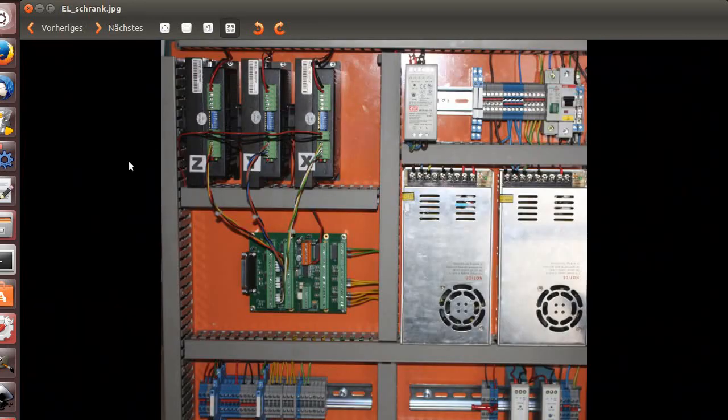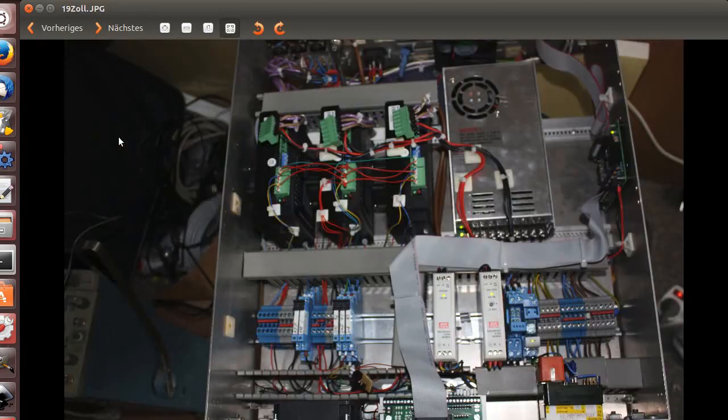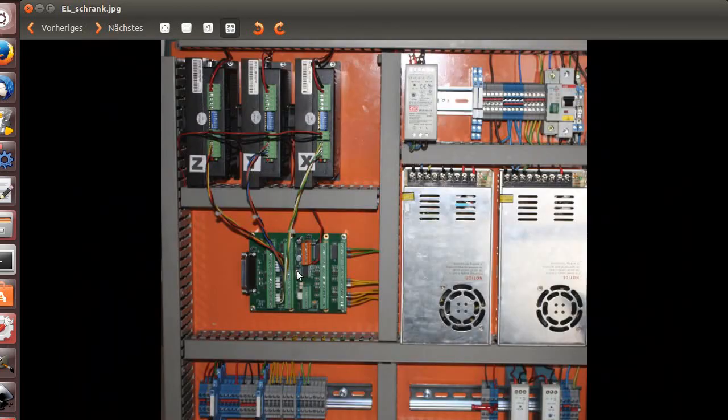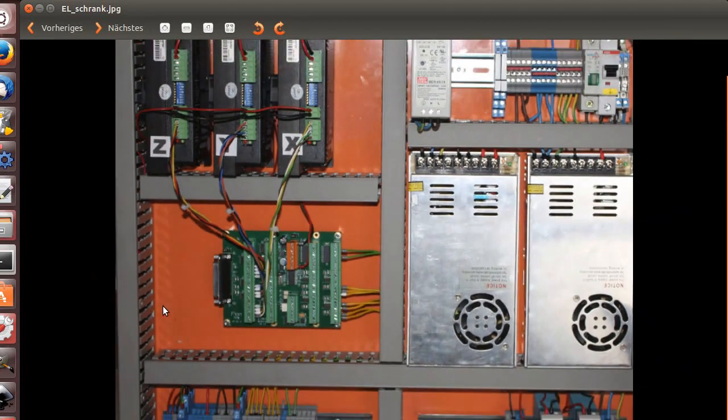And you can go also a little bit larger. This is also more expensive, but it's reliable. The system we use here can go up to, let's say, safe about 20,000 steps per second. This is maximum. That will give you around 12 meter or 200 inch per minute. And with the front end breakout board here, this is a Mesa card, you can go way beyond that. It sure will get you 2 million steps per second. It's basically for hybrid stepper controllers. You should use this one and get you a real cool system.